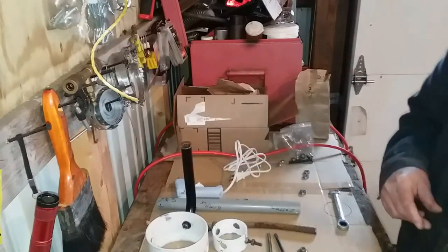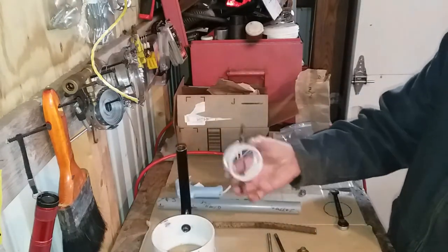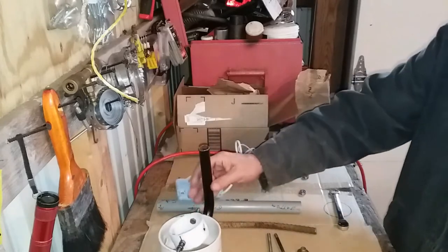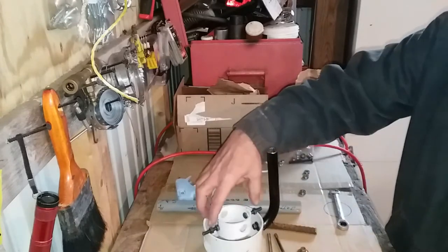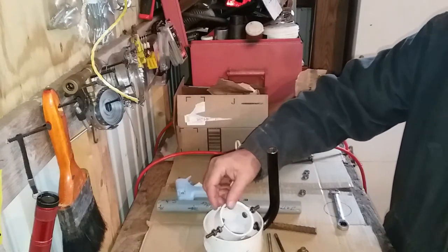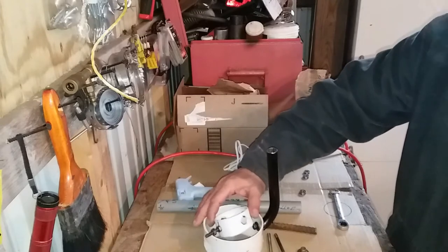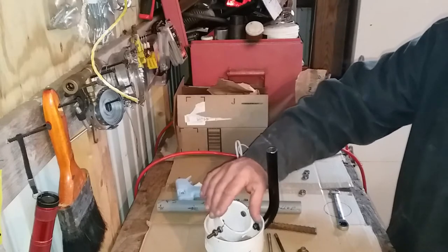that's that. Also, I wanted to bring to your attention, you might not be using the same size pipe that I'm using. You might be using different size PVCs. You can use different sizes, but what to be aware of is, make sure that with your bolts and your assemblies and your nuts and whatever you're using, that when they rock, they don't jam the side. Depending on how much movement your gimbal's gonna have and how you're gonna physically use it, can make a difference. So I wanted to share that with you.